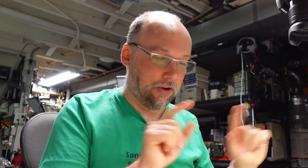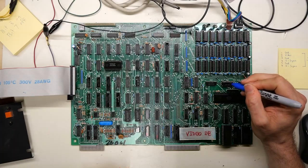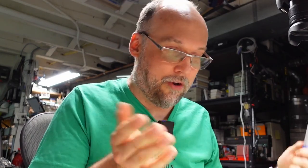All the data bits on the RAM look good now — it just fixed itself. But a second ago I was on pin two and it was definitely stuck high — hitting reset and it wasn't working. We definitely saw it on the video capture too, the graphic characters were gone. So that chip literally just fixed itself. I'm almost thinking I heated it up removing it and that kind of fixed it — sometimes that heating process can rebond things inside the chip. I'll mark an X on it and leave it in for now since I have no replacement, but I don't trust it and need to order spares.